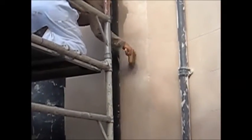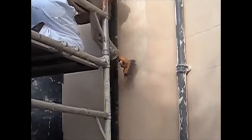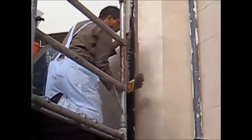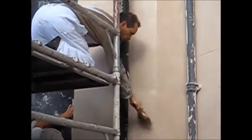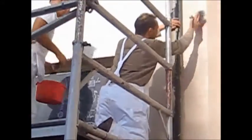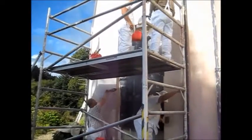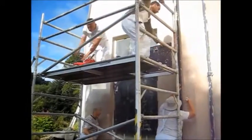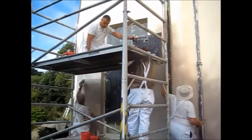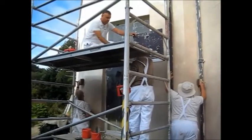The two painters are now going to start on the other side, working up our side of the window ready to meet above. Just finishing with light strokes, random directions, very lightly, just taking away the runs, creating a nice varied finish. You can work it as long as it's wet, and the minute it's dry you leave it alone — if you absolutely have to touch it, just stipple it with the dry brush. A cherry picker is needed to get in here; if scaffold is tied into the building it needs to be moved back, as you can't touch those areas — scaffold poles need to be back off the building.